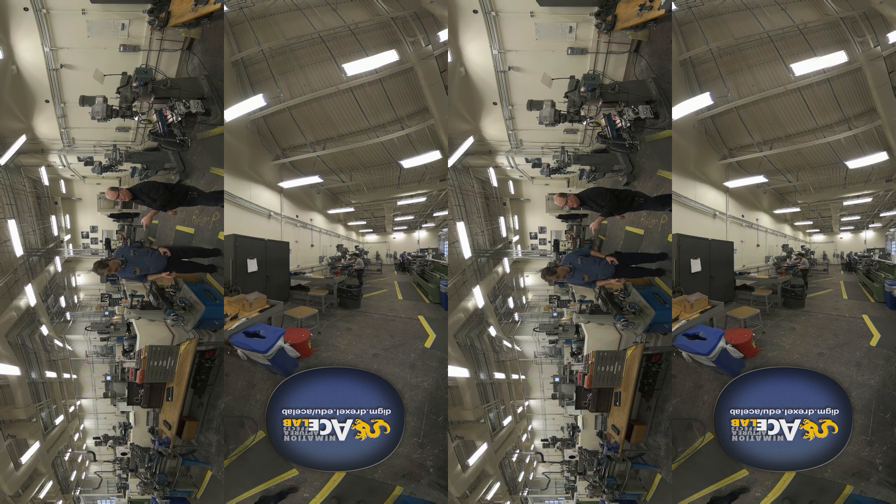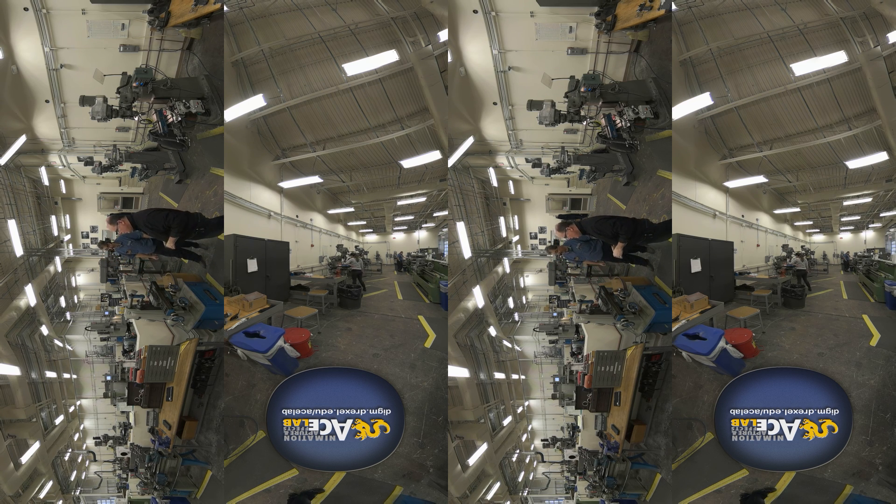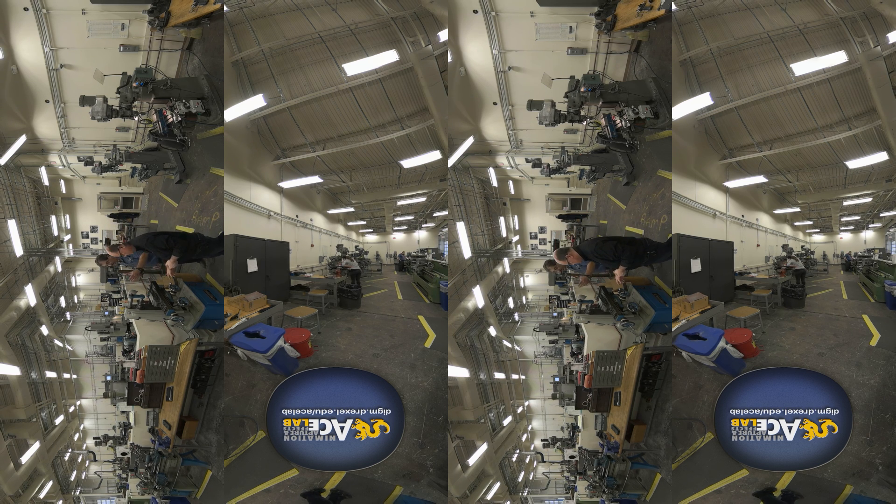What is this thing? This is a horizontal milling machine. As you can see the cutter is mounted horizontally. You can gang these up — you can literally cut a heat sink all in one shot by having a stack of cutters in a row going through a solid block of material. It's all power feed, so you can bring up your height and run through your block in one pass. If you had a bunch of heat sinks to manufacture, this would make it go.